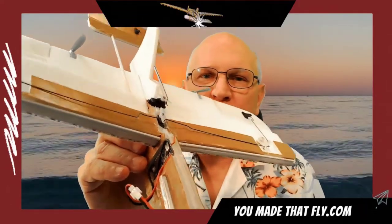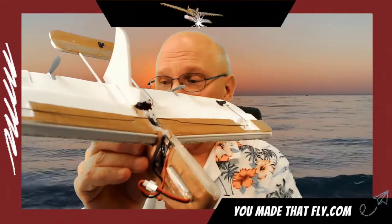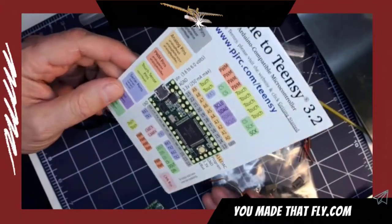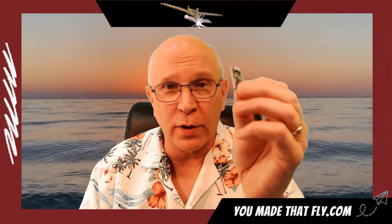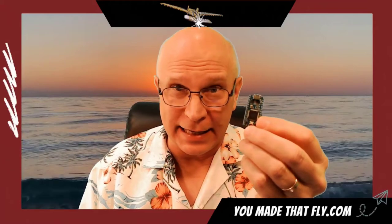Now, this is a standard three-wire servo. It only weighs 2 grams. But we did the secret sauce of adding it with a Teensy 3.2 controller. Originally, we were going to do an all hardwired system because I'm an old school kind of guy. But I realized after weighing all the components, it was already way over the 3 grams that the Teensy board, this little board here, adds to your system. So with 3 grams, you have a whole microcontroller. You can do amazing things.